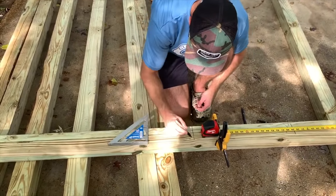I found that using snippers worked a lot better than the actual jigsaw for this, and you can also remove parts of the aluminum cavity if that's going to help you to access your cut location. So here you can see I'm cleaning up that cut with snippers, and then I'm moving on to cut out the window right here. And as you can see again, I cut that out with a jigsaw, removed the aluminum cavity, and then I cut out the bottom segment using snippers.